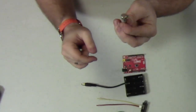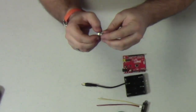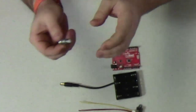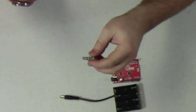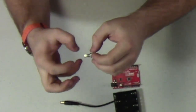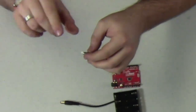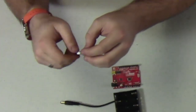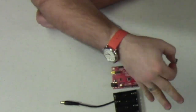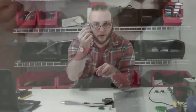The microcontroller is going to read the position of this potentiometer. Whereas this other one is not linear — it's actually a logarithmic potentiometer. The reason we're going to use this is because that's how our hearing works, so this is going to be our volume knob. You actually want this style of potentiometer instead of a linear pot because with a linear pot, as you turned the volume knob, the sound wouldn't scale the way you expect in your head. So we're going to wire this on our audio output between the Arduino and our speaker to actually change the volume. The microcontroller won't even know that this is there.